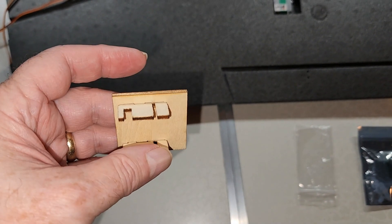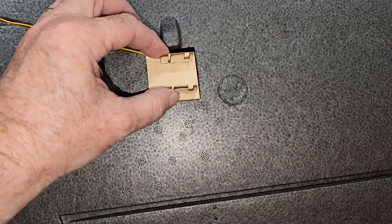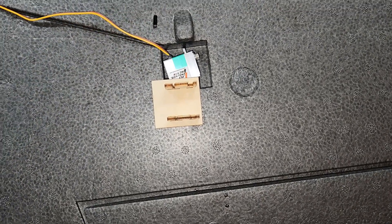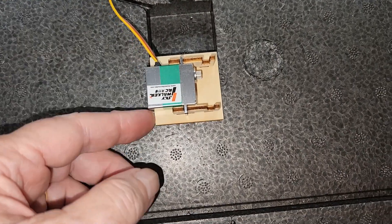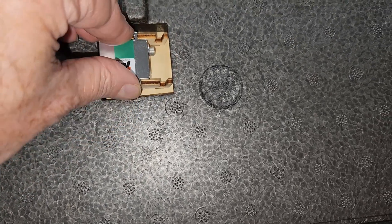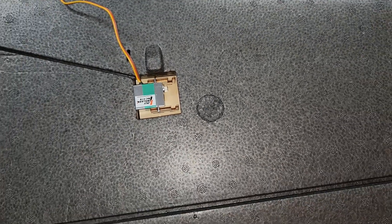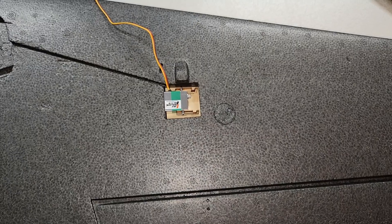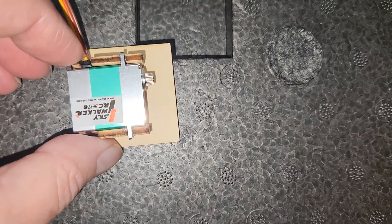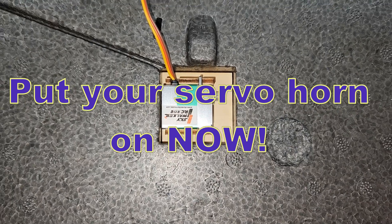A little place to mount the servo. At first I put it in there like that, and this area of wood right here — let me show you what happens if you do it like that. Although the servo does fit and this will go down in there, you can see right here this wood is going to stop the movement of the servo horn a little bit in that area. So I found if you just turn it around, everything goes in very well. The wire comes out of there, and that goes in nicely — that looks like it's just gonna be beautiful.